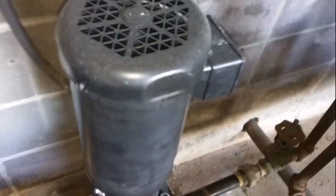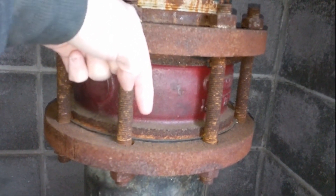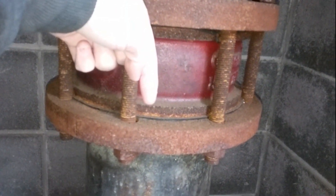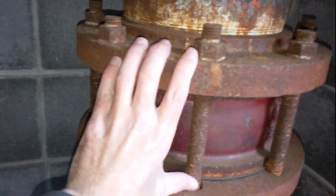I'm having a situation where my jockey pump won't turn off. On my fire pump bypass I have a wafer check, and the flap is hanging down. The reason why my jockey pump is still running is because it is coming through here and leaking past my check.